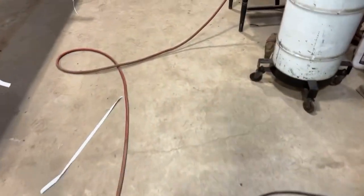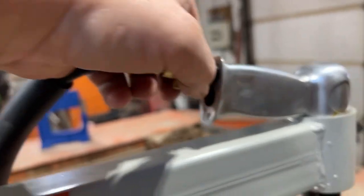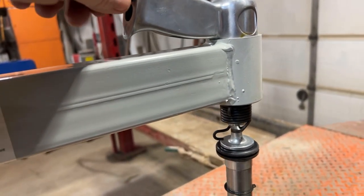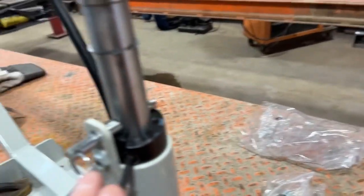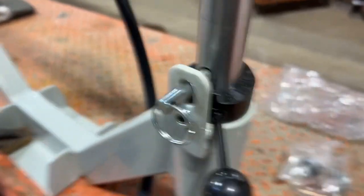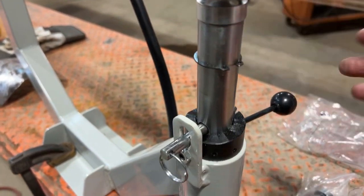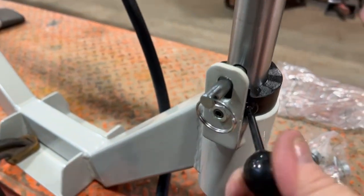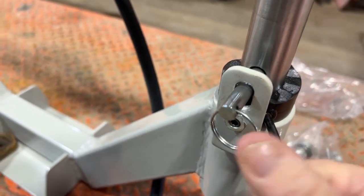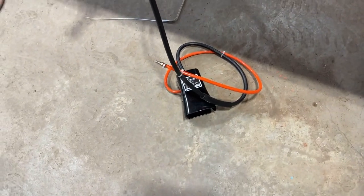Well, part three. This thing here, I'm pretty happy with it. It's got a little regulator valve — you can go pretty light with the blast or pretty heavy. The adjuster doesn't jump out like I figured it might, but you just do a couple little clicks. You can really work with it. She goes right to the top and stays there. Tighten that knob up — it's not tightening. So that's going to get some epoxy.